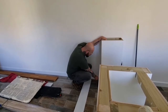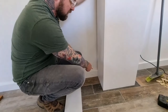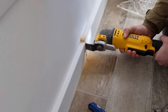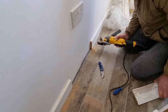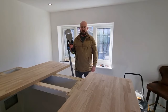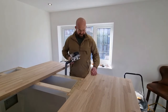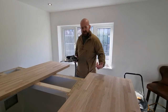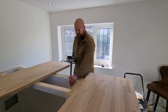The bar's going right up against the wall, so I'm marking exactly where we want it. I'm marking on the skirting board and going to use the multi-tool to remove a little bit of that. We're using the Domino for the alignment of the worktop, then we'll push it, clamp it, push it all together nice and tight, and then screw it in from underneath on these parts here.